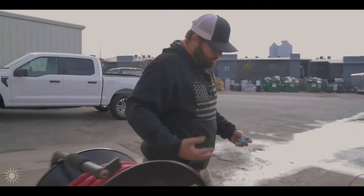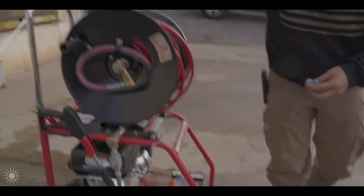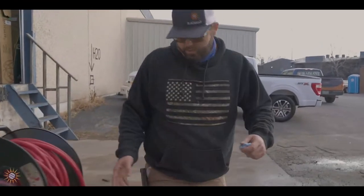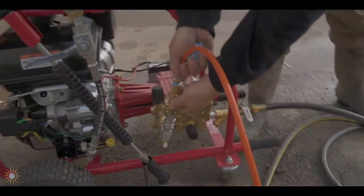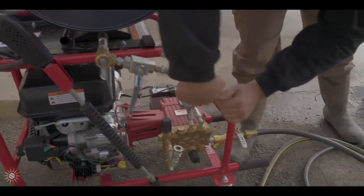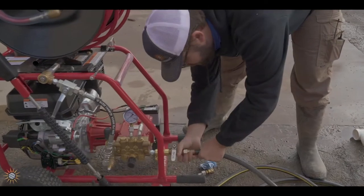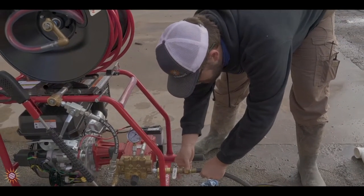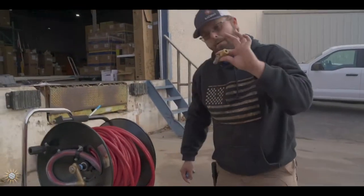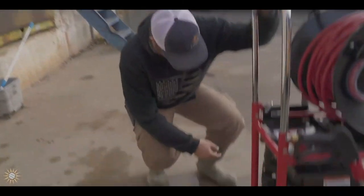Now go ahead and start cleaning the machine up. Everything else is pretty much the exact opposite of how we started it. Water's off here - go ahead and turn the water off at the building. Disassemble the orange hose and reconnect the red hose - take off just the attachment, roll it up in a minute, take the other attachment off, bring it back around and hook it back up. Then unhook the actual water connection and let it run out. If you're transporting back in the truck, reopen the ball valve for a minute to let extra water roll out, make sure it's off, put extra tips back, and flip your gas off before transport.